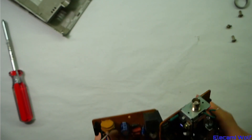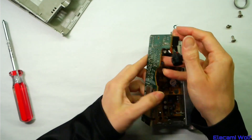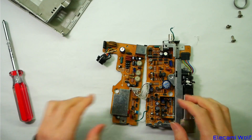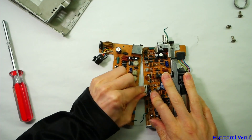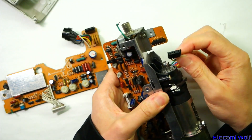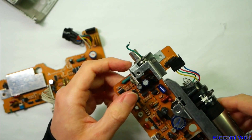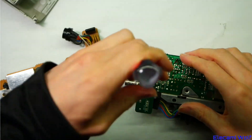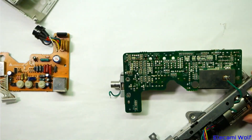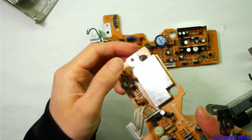It's a pretty old school thing. I think that there's the flyback transformer to produce the high voltages, and then there's various rectifier diodes there. The ground wire is soldered, but the other signals can unplug. That pickup thing unplugs. Deflection unplugs with an interesting connector there. Transistor heat sinking to the metalwork. Another ground wire there.